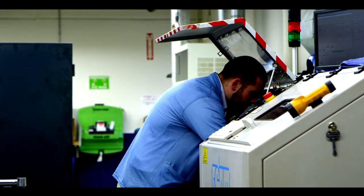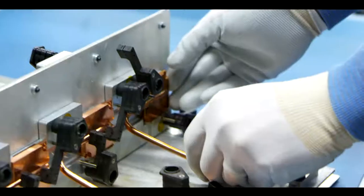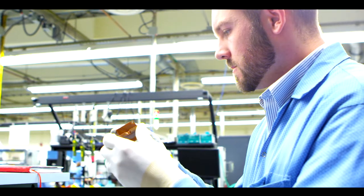This allows heat to be applied to one end, causing the water to vaporize and move near the speed of sound to the other end, where it condenses back into liquid water and drips back down so the cycle can start all over again. Another neat thing about this is that we're making this right here in Pullman, Washington. The heat pipes and copper slugs are bought and then soldered here for cost and quality reasons.